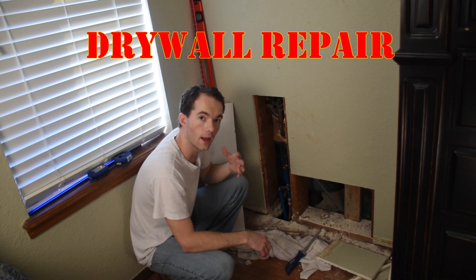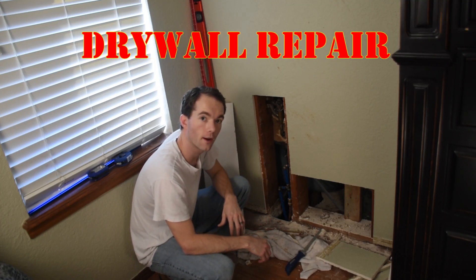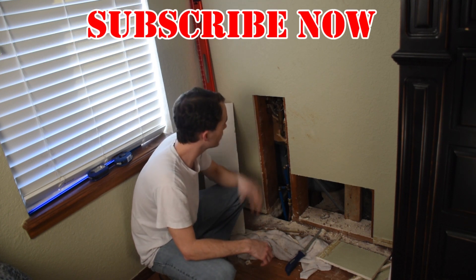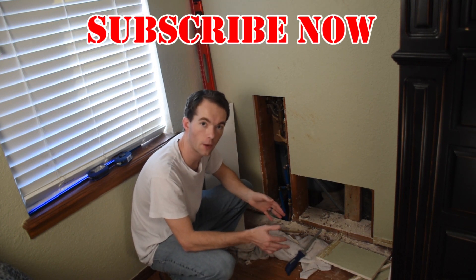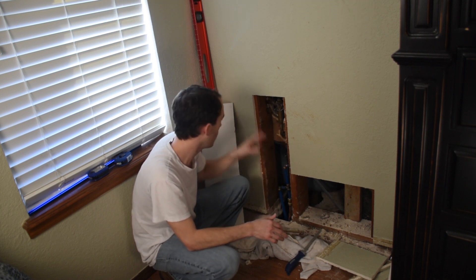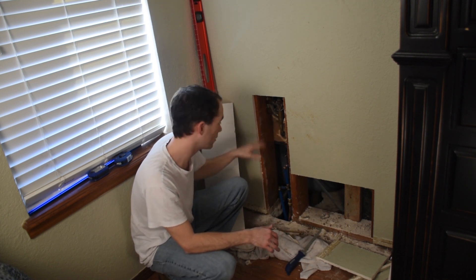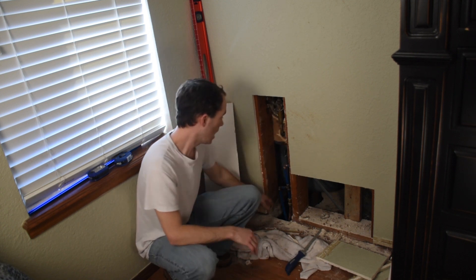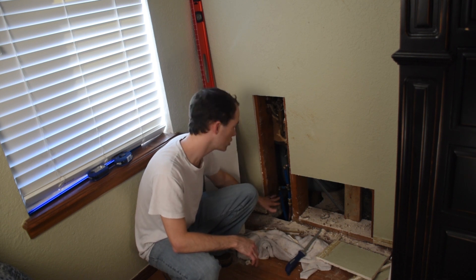Hi, I'm Mike Thompson. Last night was a bit of an adventure. My son found a leak behind our bathtub. We thought originally it was the faucet that had finally just gone bad with some seals that had been shot, so we were expecting to replace a faucet. After making our own access panel, I noticed there was a puddle down here in the tub trap area in the dirt just underneath the slab.